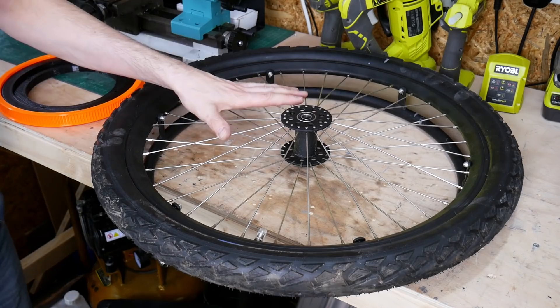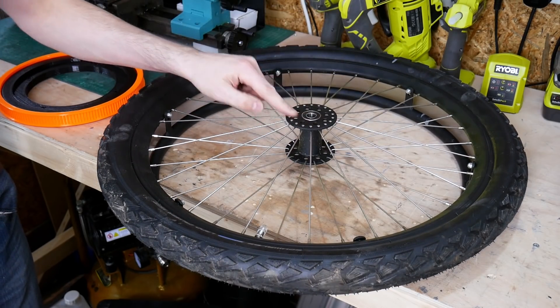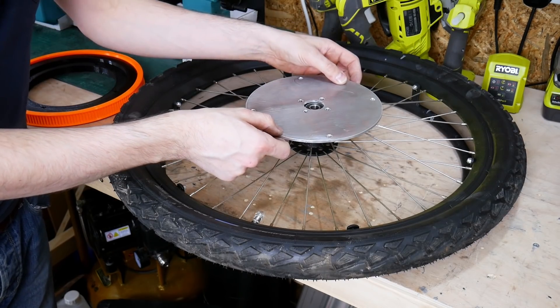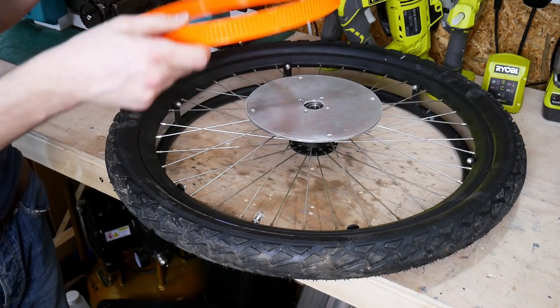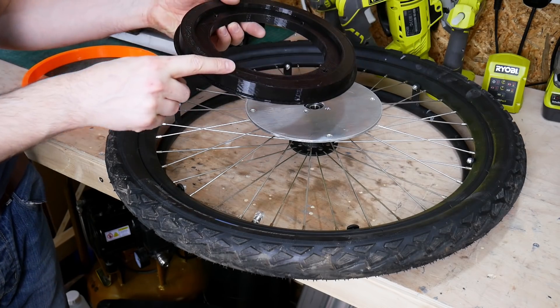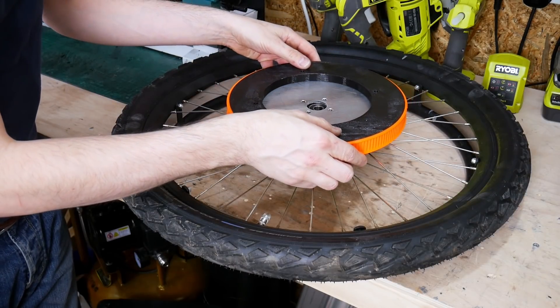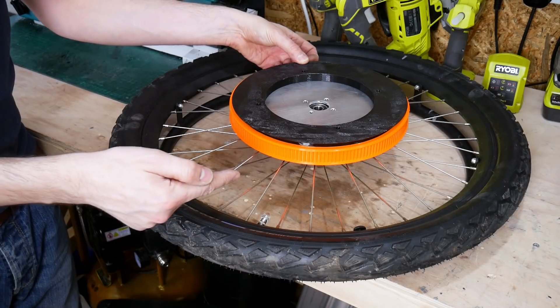These are off-road heavy-duty wheelchair wheels, which should be pretty substantial — they've got a hub with some holes in. I've made an aluminium bracket that fits on there, so that's nice and tough. Then we've got two 3D printed parts: one printed on a normal extruder with pulley teeth — really good quality — and a hub printed on the Morstruder. Those fit together perfectly over the aluminium plate to make a nice hub with a pulley on that we can drive with a motor.